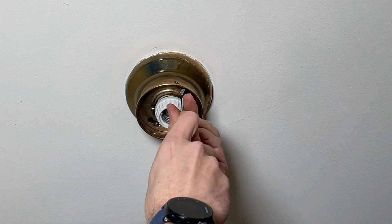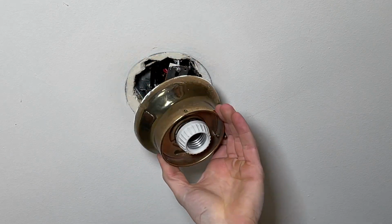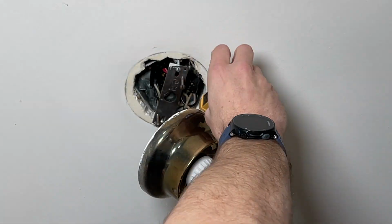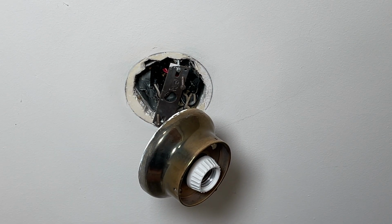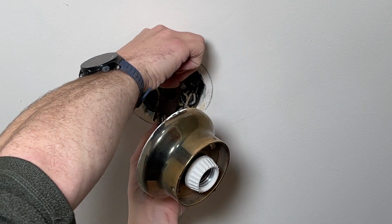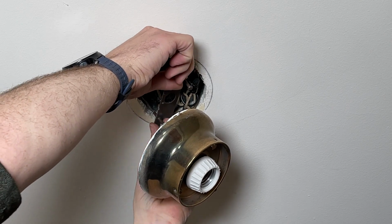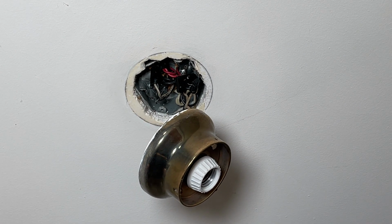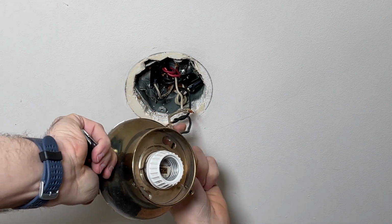Removing the old light fixture is easy. Just back out or loosen up the 2 machine screws, rotate, and then that will release the housing. Now I'll double check with a non-contact voltage tester to make sure there's no hot wires inside the electrical box. Then I'll just undo this bracket, and to note, you can look down in the description to see the tools that I'm using and also the light that we'll install in this video. So once that bracket is out, I'll go ahead and undo the 2 wire nuts so I can completely remove the housing.